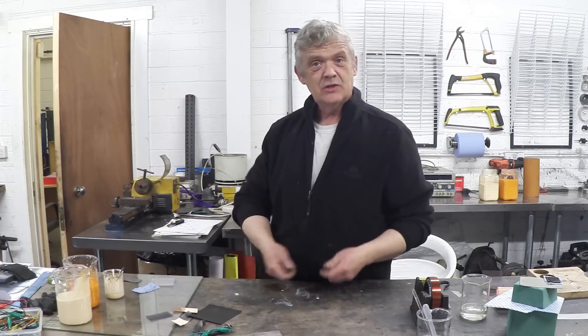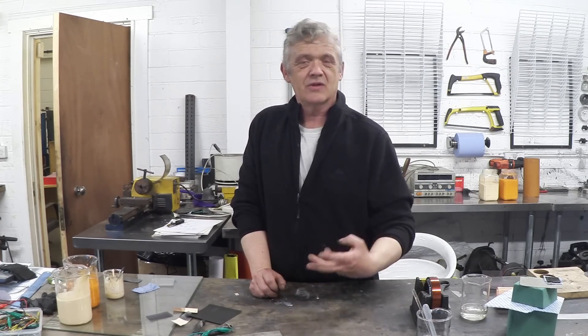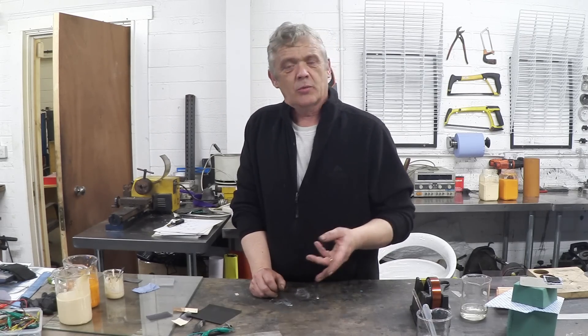There's also something else about them. When they make them, the traditional method is to take a bit of copper plate, get it clean, stick it on a hot plate and burn it until it goes black. When you've got a nice thick black crust on it, you knock that off and you've got some red underneath — that's the copper oxide you want. There are two forms of copper oxide: copper one and copper two. Copper one is the red stuff and it's photoactive — it's a native p-type semiconductor. Copper two, the black stuff, isn't, so you get rid of it. As a production method it's a little hit and miss, the coating is cracked and very uneven, and those are the reasons why they don't work particularly well.